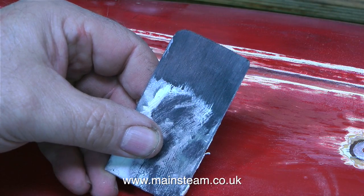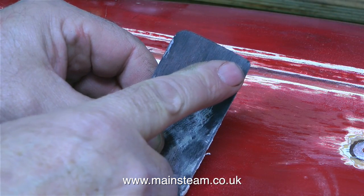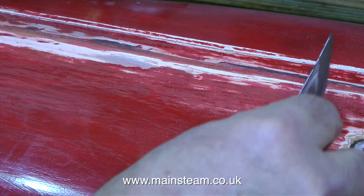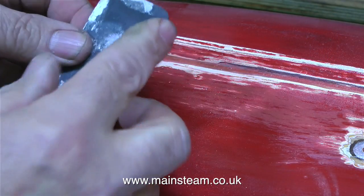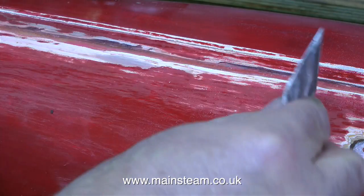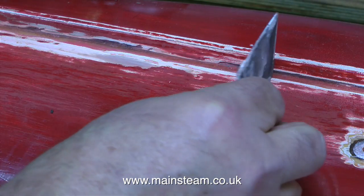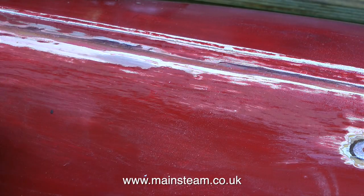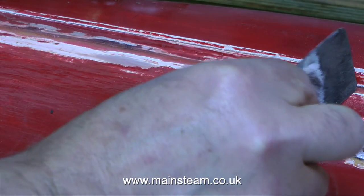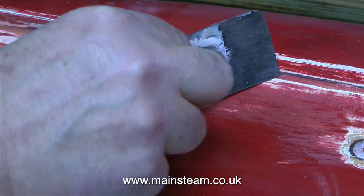In the top of the car body kit tin comes a plastic applicator. What I've done is rounded both ends of it — one to a slightly larger radius than the other — because I do not want the car body filler to be at a perfect 90 degrees to the keel. I want it to smooth into the keel, and by shaping the applicator this way I can get a nice fillet of filler all the way down the keel, which will save some sanding time.